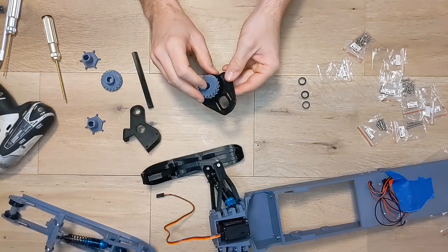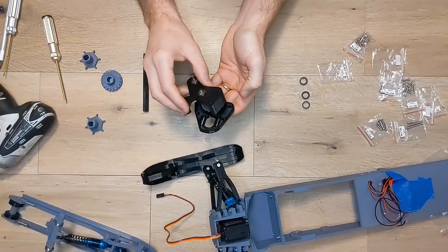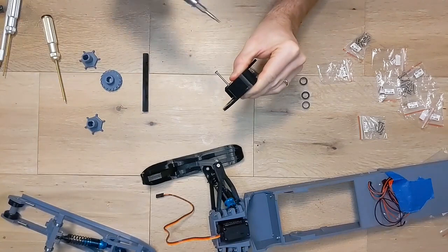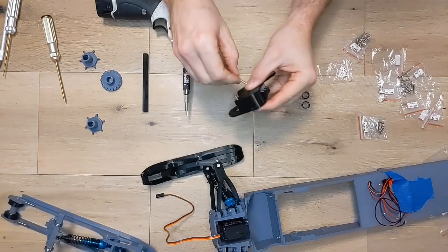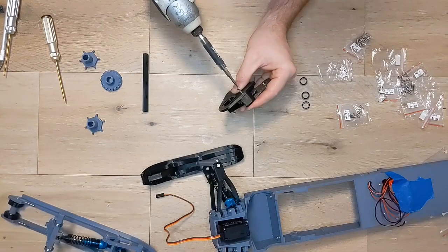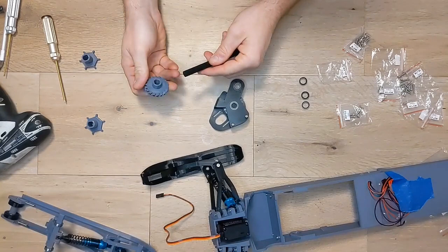Put the cover plate on top and rotate it until the holes in the base plate line up with the holes in the cover plate. Sandwich these two plates together hard and then drive two M3 by 30mm screws through the left side of the cover plate and through the base plate until they're just past flush — holding the plates together but not all the way through. Then add an M3 by 12mm screw through the base plate first and into the cover plate in the remaining hole nearest the top of the case. Next, grab your sprocket axle and slide on the other herringbone gear with the flange facing inwards on the side of the axle that has the hole closest to the edge. Secure it in place for now with an M3 by 14mm screw.